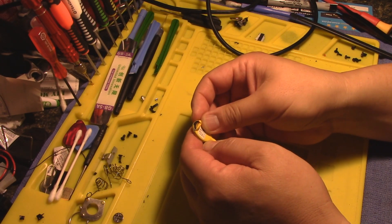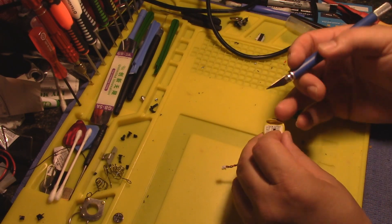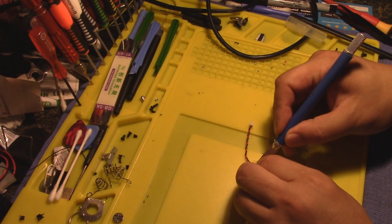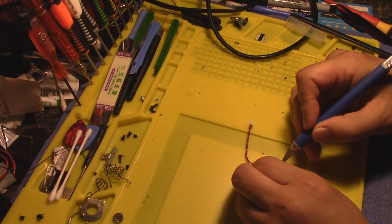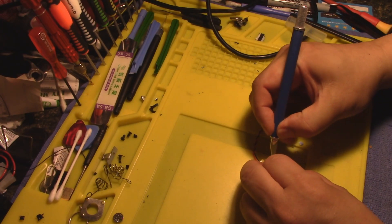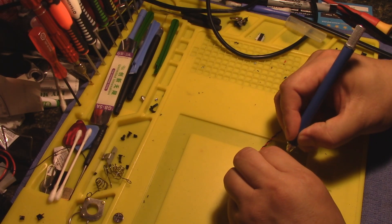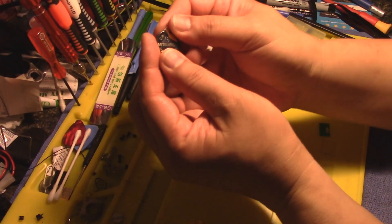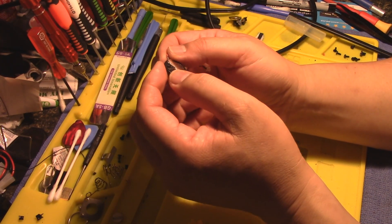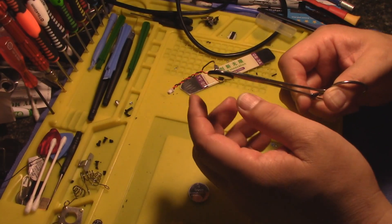Okay, let's open it up and see. It says '32,' so probably this is a 2032. It says Mitsubishi. I'm taking a pair of small hemostats and just rolling it to peel off the weld here, and it's working.